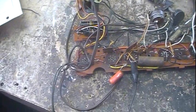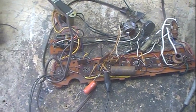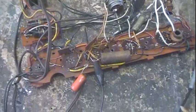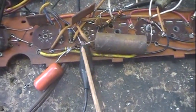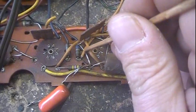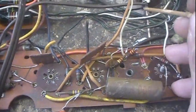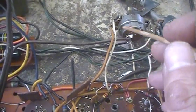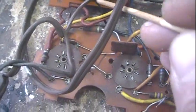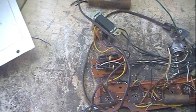One question was that I didn't make it completely clear at the start of the video how I had the meters hooked up. Basically at the radio, I had it hooked up with this clip lead right here, which goes through this wire and right up to this point — this black wire — which then runs over to the switch right up here. This wire here is just part of the line cord, and that traces back through the cord and back to the isolation transformer's secondary isolated side via the variac.